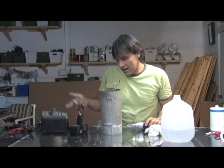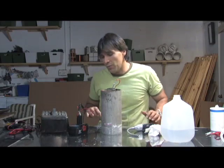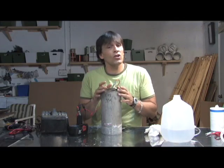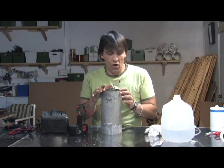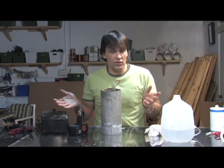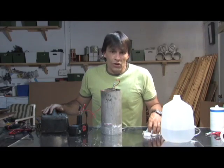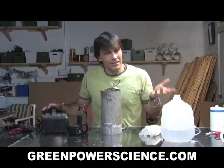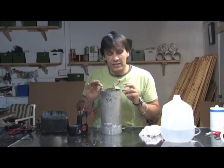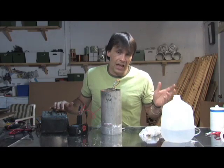With this battery we're pulling about 4 amps, so 4 amps at 20 volts — which is about what this battery puts out — comes out to about an 80-watt bulb equivalent. These pull amps; the more salt you put in the more amps you're going to pull, and the more amps your car pulls the harder your alternator works. The energy that runs these doesn't just come from nowhere. You can add extra batteries charged with a solar panel, but then you're adding extra weight, so are you actually offsetting the efficiency? I'm going to be sealing this up, making it as efficient and safe as possible, then running it into the air intake of our car to see how it affects our mileage.